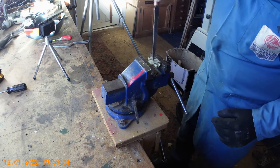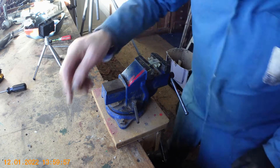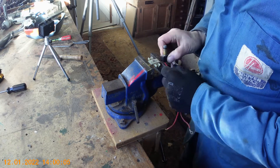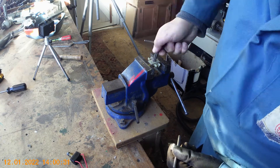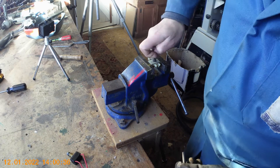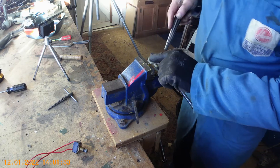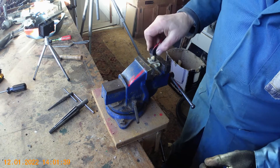Now what I've got to do is drill this hole out to accommodate this switch here, so it's got to be that size. I can use a drill but I'm worried it might race through the plastic. So I'm just going to try doing this with a reamer to start with because it's less invasive than using a drill. I don't want to get the hole too much off centre. By doing it this way it keeps the hole more central. There you are — see, that's a perfect fit.